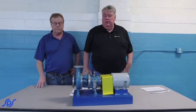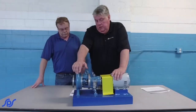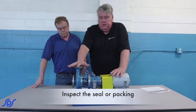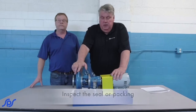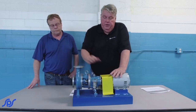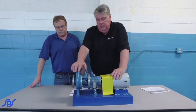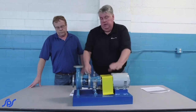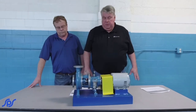This particular pump has a mechanical seal. You want to check to make sure it's got the proper adjustment. There are usually instructions with each seal — you have to install it or do adjustment on it that tells you how to get the setting once you've done your other adjustments. Inspect that and make sure it's correct. Sometimes they're shipped with a spacer or a shipping fork and those have to be removed, with maybe a final lockdown after everything's in place.